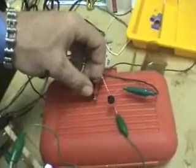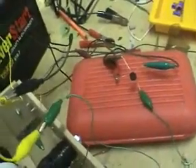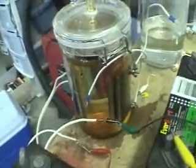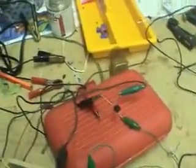On the back of the coil I have this black lead going to part of the AC on the bridge rectifier, and the other part — the green one — going to the other side. The positive red lead coming off the bridge rectifier is going to go to the electrolyzer here. I only have one clamshell hooked up. In my last videos I only had one, but I built another one on the other side — that is disconnected. So the only thing hooked to the electrolyzer is the green lead off the negative from the bridge.